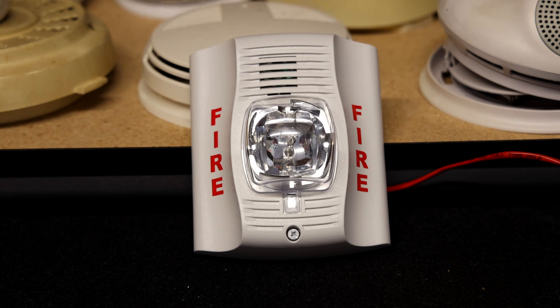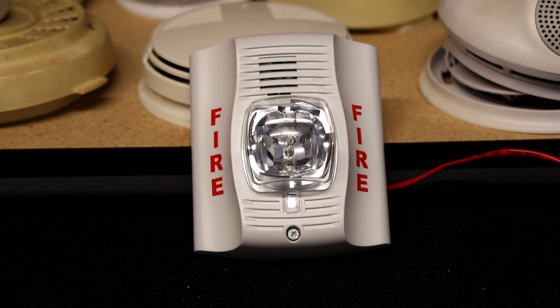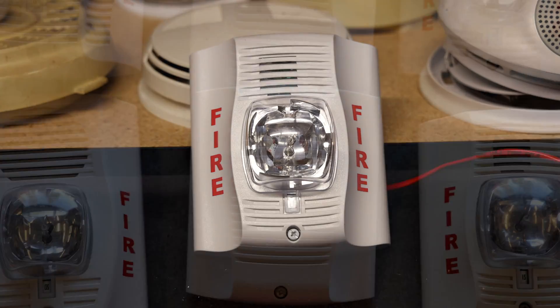I do see how this setting could be used somewhere like an operating room where you really only need the tone to sound once. People will see the strobe, know there's a fire, and if it kept going off it would just be a disturbance. So this one chime setting will make noise and then just flash. You see how the strobe never turned on? If you had a code with a long interval between each beat it might work, but I think it's really more designed to do one tone and then flash.